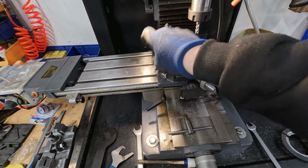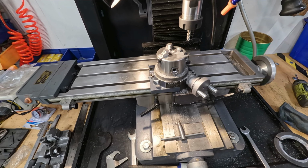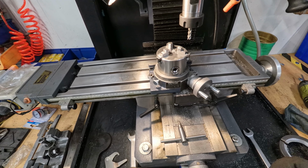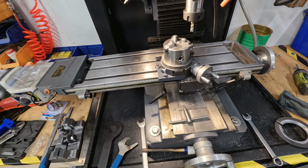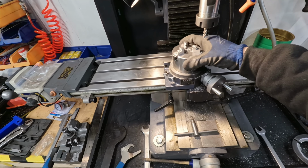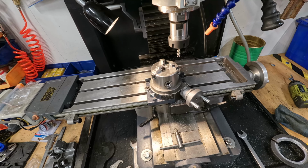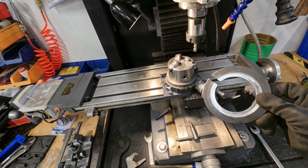One thing about that screw that I tightened: do not, I repeat, do not tighten it with the impact. It needs to be a little bit loose because it's a bearing, so if you tighten it too hard, it won't be turning. So lesson learned: use force but do not use too much. So it is now as tight as I can take it, but there is quite a lot of slack, so it's not for precision, but it was so cheap that you shouldn't expect any precision from that cheap device. So it is what it is, but you can do this kind of not-so-precise job on it.